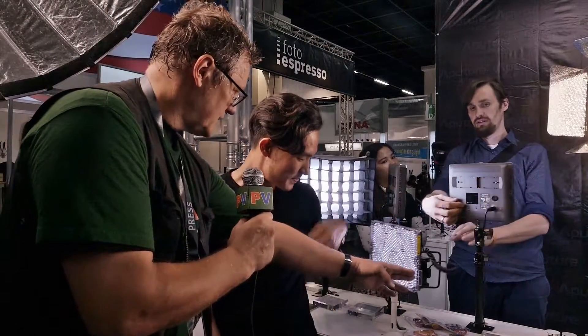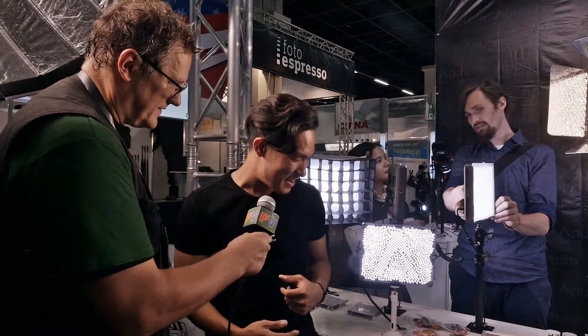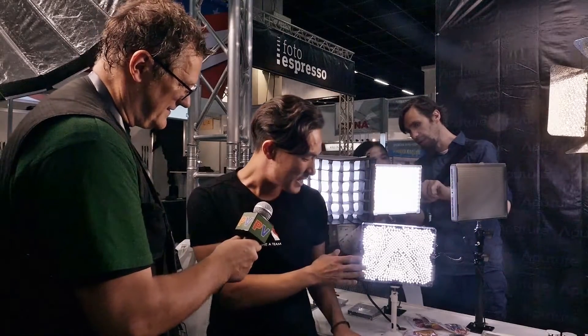Now you've got a strange setting of the LEDs — explain why. You noticed. So basically it's an Aputure A logo. The reason we did this isn't just to have our logo on it — though that's cool too. If you have LEDs in any sort of recognizable pattern, you'll notice because each LED gives out a slightly different small shadow. If they're in rows, you'll see those bars from the LED. By mixing them up, we actually get rid of that shadow and randomize the effect so it's not noticeable.